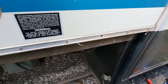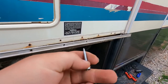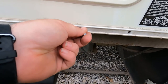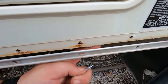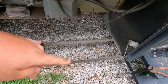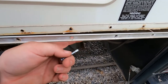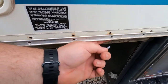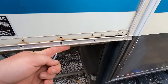We just want to do that for all of them down here to hold the door. This is the hardest part — this is where our screws come in. We'll stick them through. The door actually pinches behind this right here, so you'll either have to take a jack or some wood and hold your door up when you get it in here. Get a couple of screws started, and then once you get a couple started, you don't have to wait — but I'll probably have someone help me. So I don't know if I'll get video of that or not, but we're going to go ahead and do it.